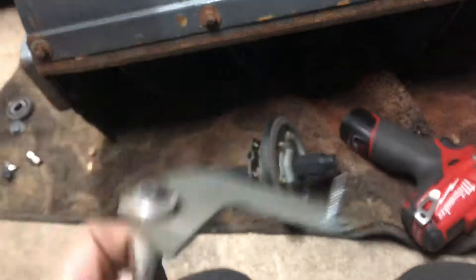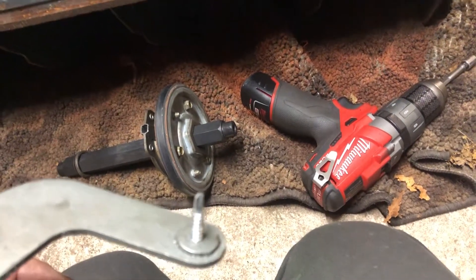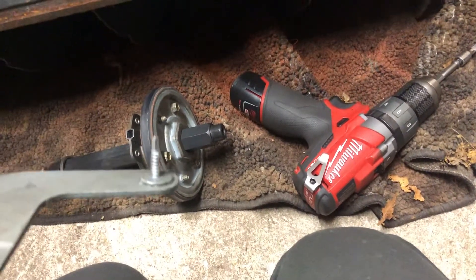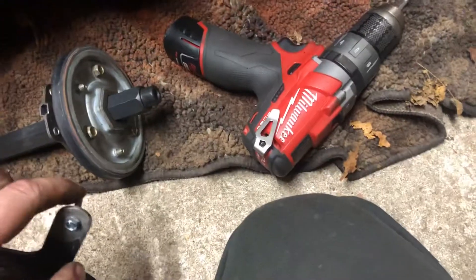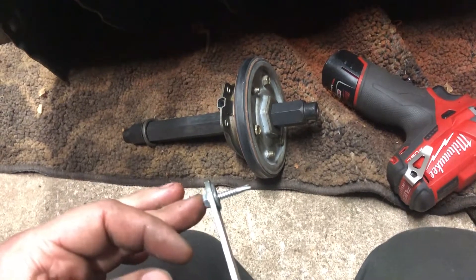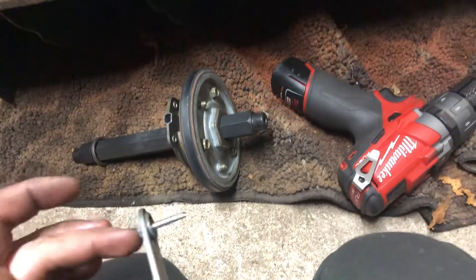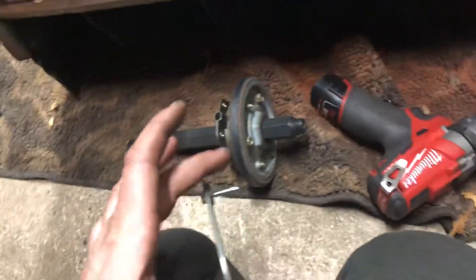This shaft here had to be completely reverse-engineered. So originally where this tech screw is, there's a nub on this side — I cut off the nub, I ground it flat, and I ran a tech screw. The nub was here, so the tech screw runs out this side over here because we're flipping this over.